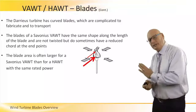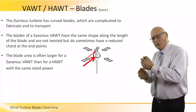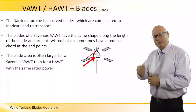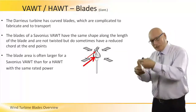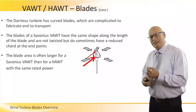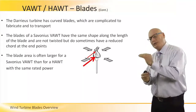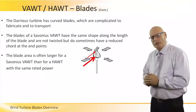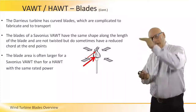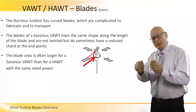Not only does the wind slip along, but there are also mechanical forces. And this is in all directions of the wind. So this difference in the torque level between different wind intensity along the height of the blade itself causes vibrations and mechanical stresses.